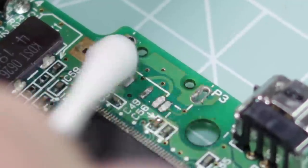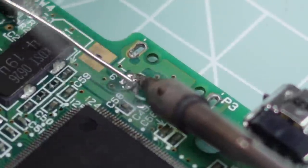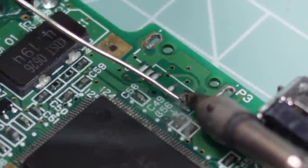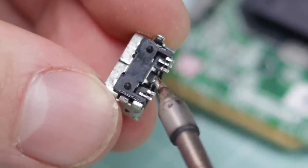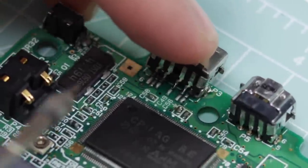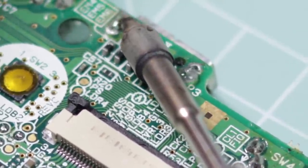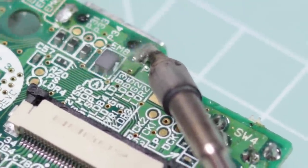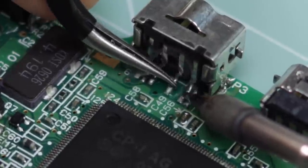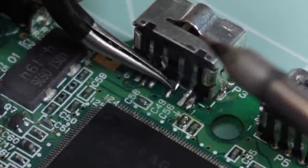We're going to put this charging port on this Game Boy. I'm going to go over some of these solder points as well, because whoever used this before has probably ballsed it up a little bit — we can just reflow it all and hopefully we'll be good to go. The first thing I'm going to do is clean the whole area with some isopropyl alcohol, then apply some flux to the pads and put some fresh solder on. Annoyingly, the replacement charger port I ordered turned out to be the wrong one — I thought I just had to bend the legs, but they didn't even line up. I did have another one in my parts bin though, so that worked fine. I started off by soldering the ground pins either side — they act as an anchor point for when we solder the individual pins on the back. I put some fresh flux and solder on those to make sure the ground connection was really good. Then I used needle-nose tweezers to push the pins down as I soldered them onto the pads.